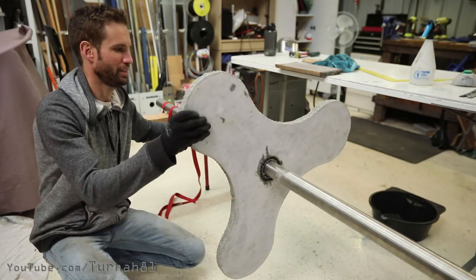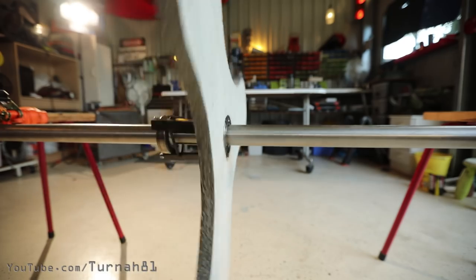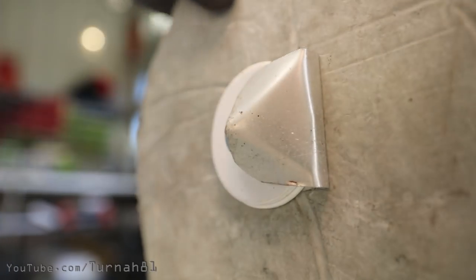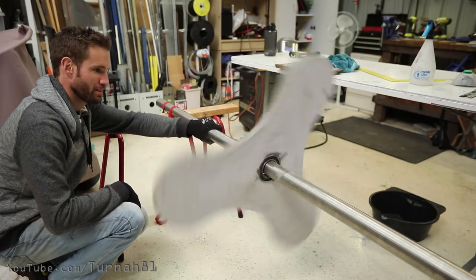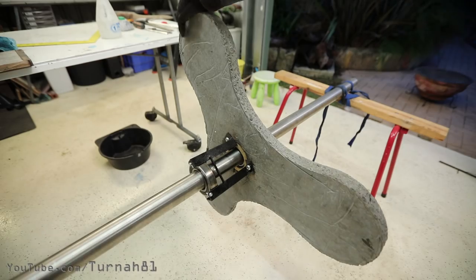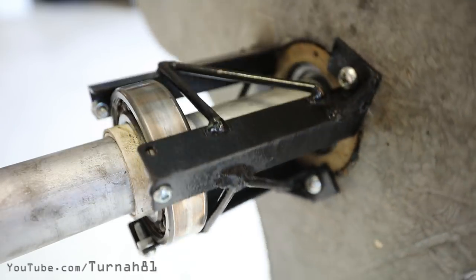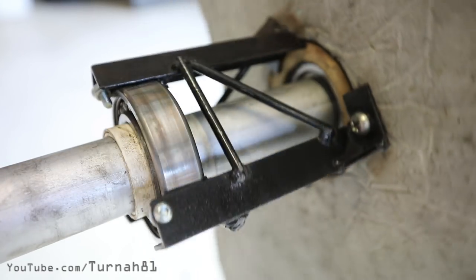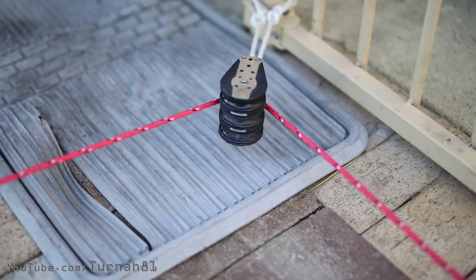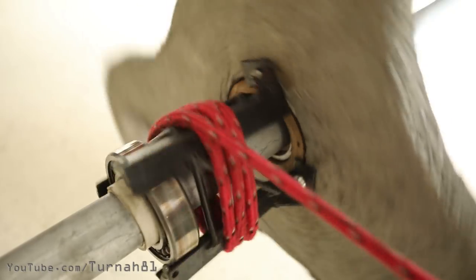The exposed aggregate edges are looking pretty nice. The bearings are holding nicely within the concrete and I do believe we are ready for some spinning. The giant reinforced concrete fidget spinner seems to turn pretty good. There is a bit of a balance issue so I've put in some bolts and some weights on the lighter arms just to even everything out. Now this thing has a lot of mass behind it — even spinning it fast by hand I reckon if this thing came down on my leg it's going to break a bone. One of the benefits of having the bearing cage mounted on the side is I've realised I'll be able to tie a rope around this and use it to spool the fidget spinner up faster than what I would have been able to do by hand. I've used a long length of rope and rigged up some pulleys because I don't want to be on the same rotational plane as this — I just keep having visions of what happens when something big and spinning is pushed beyond its limits and catastrophically fails.